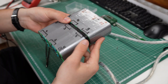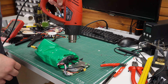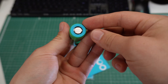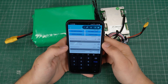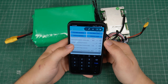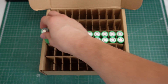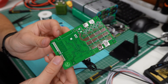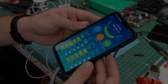By the end of this video, you'll be able to build complete battery packs which will be able to power all of your power-demanding projects. I will be building a high current battery pack with 20 Samsung 21700 Li-Ion cells. The battery pack will have all of the necessary features and protections in place, with an added bonus of Bluetooth. With the Bluetooth app, you'll be able to check the battery voltage, temperatures, both input and output currents, as well as program custom values to make it super safe while taking advantage of all of its power.